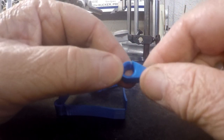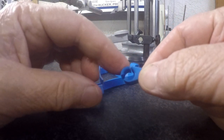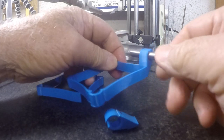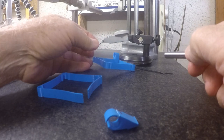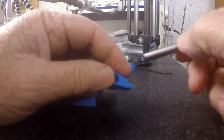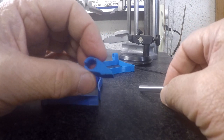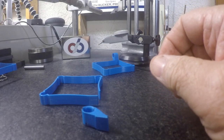As you can see, I tried to shove my indicator into it. When this is freshly printed, the pin is basically 300 thou. A standard indicator stem is anywhere from 373 to 374 and a half. I figured it's plastic, it'll spread out — well, no it didn't. So I knew I was going to have to bore this unit to make it fit an indicator.